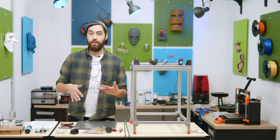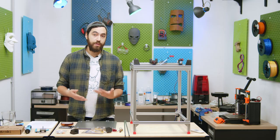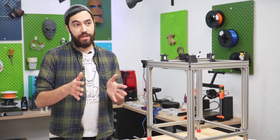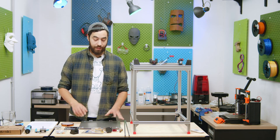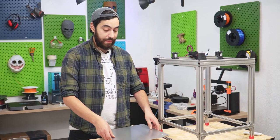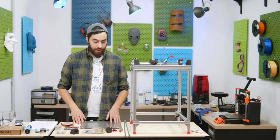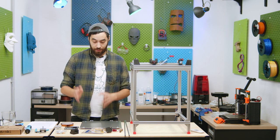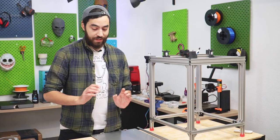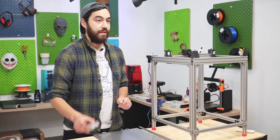There are a lot of details and tutorials online — I don't want to go into too much detail here about how to do this, it's relatively basic electronics — but just keep it in mind when putting your bed together. Another difference between the big bed and the little bed is the power consumption. There's a lot of wattage going through the big bed compared to the little one, and the main board can't handle that much current. For the little bed it's totally fine, but for the big one it would just burn out the main board.